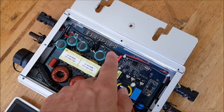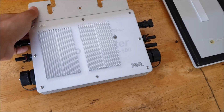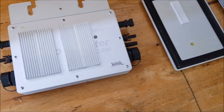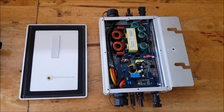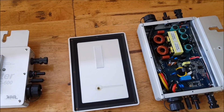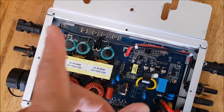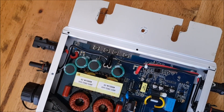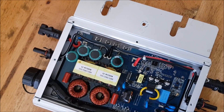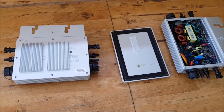It's a clean build but it seems to have quite a lot of design problems, in particular the DC MOSFETs — they do not stand the test of time. When I got them I improved them a little bit by adding extra heatsinking on both sides to help with our hot temperatures. But it did not help too much. After exactly one year, both of these failed with the same malfunction — both had shorted DC MOSFETs. After I replaced those shorted MOSFETs it worked for exactly one day, and then the same thing happened again. There's probably some issue also with the gate drivers or similar. So my recommendation: do not buy this type of inverter. The quality is just too terrible — it's a waste of money.